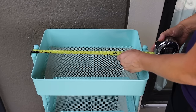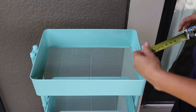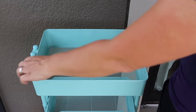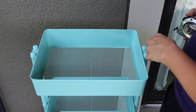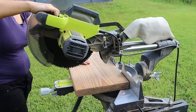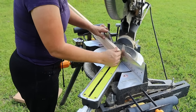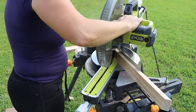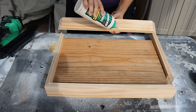We're going to measure the length here and that is 17 inches, and we already know that it's just about right on the depth. I'm going to decide whether I want to put some braces on the inside or if I want to wrap it. I'm leaning towards wrapping it to give us a little bit more space to do some hooks. We made some simple miter cuts all the way around, used a little wood glue and some finish nails, nailed that into place, and let that dry.